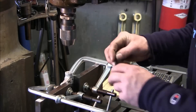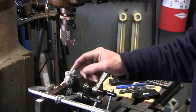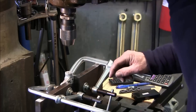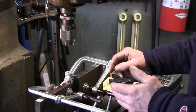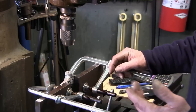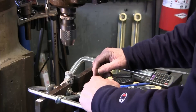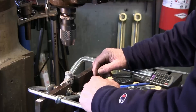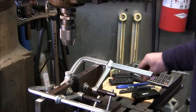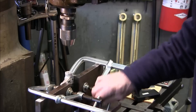Drilling down through here we had a mishap because there was a hollow back in on this side, and a divot went in and caught our drill — we hadn't got down to our depth yet. I knew I was going to have to do something with it, so I pulled it out and we rotary burred out this whole thing. I got it sealed up, came back, re-zeroed in on our piece, and we're going to drill down and tap to put our plug in there.